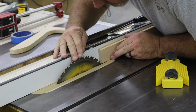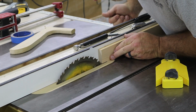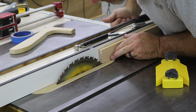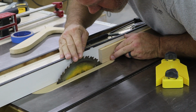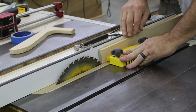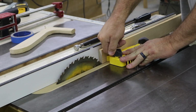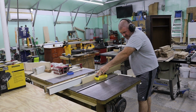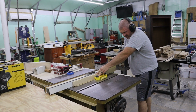Now let's cut an angled piece to match the tilt of the chisels. I don't know what that angle is. It was easy to mate the board to the angle needed. I just placed a chisel in the rack like it would normally sit. Of course, the tip of the chisel would touch, but only the tip. I got the measurement from the distance between the chisel at the lowest point of the back support board, which in my case was 1/8 inch.